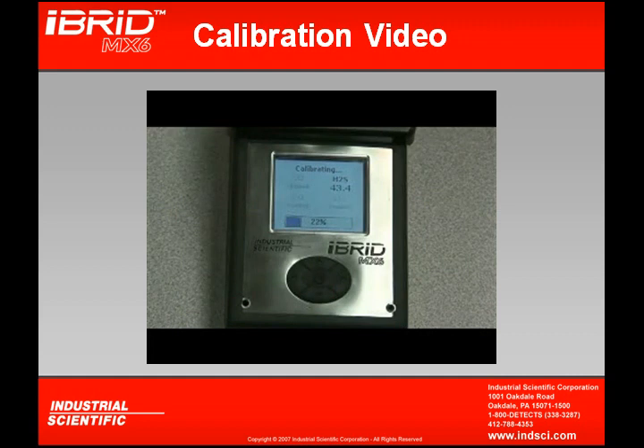The H2S sensor is starting to respond to the gas and we're seeing a full span indication appear on the display — with a full span of 47.3. If there were no indication at this point, it would mean the sensor is not detecting the gas, which could indicate that sensor may fail calibration. Upon completion of the H2S, the next sensor is 100 ppm of carbon monoxide. You'll also notice on the display that the two previous sensors are grayed out, and the O2 sensor shows the word 'skipped,' indicating it calibrated while zeroing.